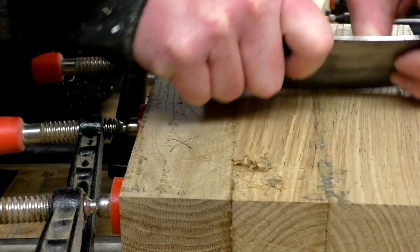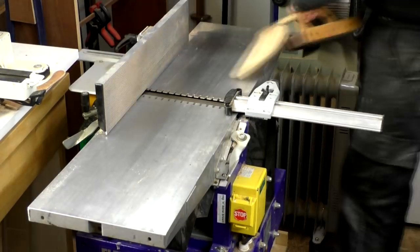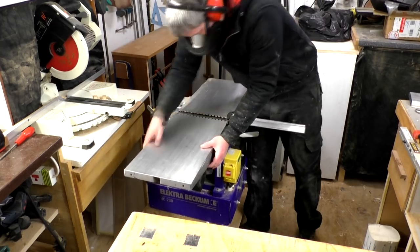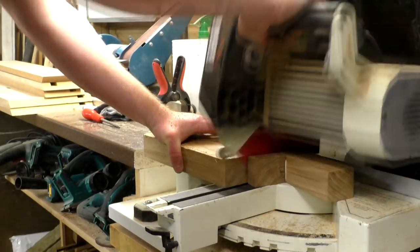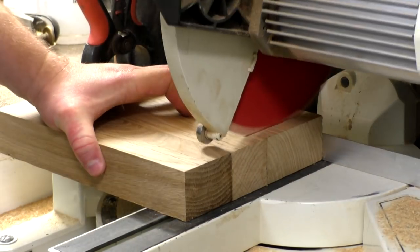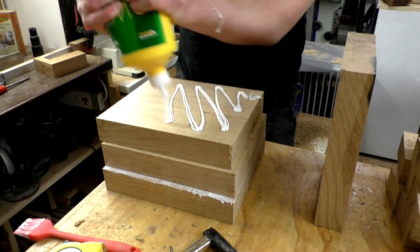After leaving them for an hour or so I scraped off the excess glue with a card scraper and then left them overnight. Then I planed down the laminated blocks — planing the already planed faces again just to make sure all of the pieces were flush with one another. I set up the planer as a thicknesser and did several passes on each piece to get the unplaned faces flattened and square. I used the mitre saw to trim one end of each block and then set up a stop block so that I could cut each block to a consistent length, which was the length I wanted the mallet head to be. I glued up the pieces to form two halves of the head and would glue up the two halves later on after cutting the joinery for the handle.